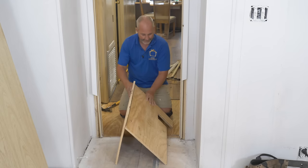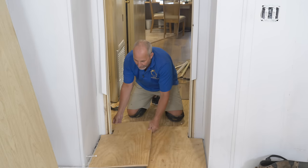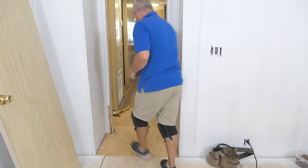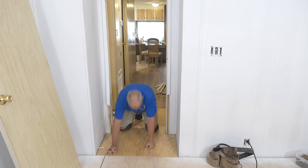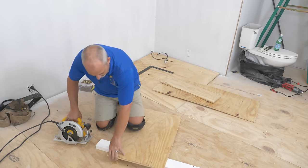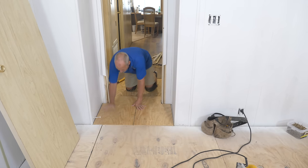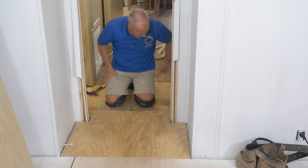I'll start this way and slide one piece in — looking pretty good so far. Slide the second piece in. The only thing I'm not crazy about is the gap here; since I'm trying to catch a joist and I've got a little room to maneuver, I'm going to take off that quarter inch to close the gap and stay nice and tight and square. Taking the time to be picky like this is the difference between a job that really performs well and a warranty issue down the road. Now that is going to screw together really nice and tight — perfect every time. That pretty much finishes the sub-flooring.